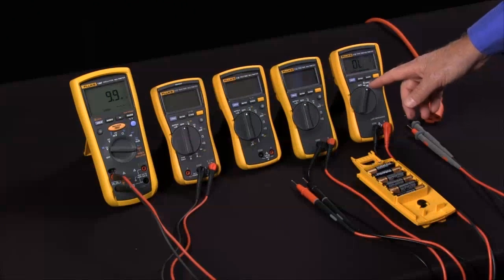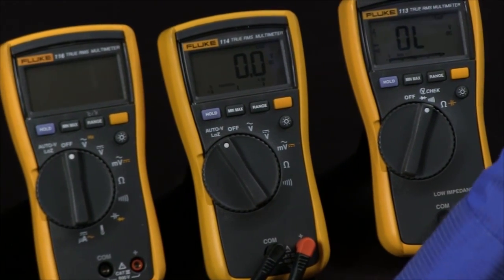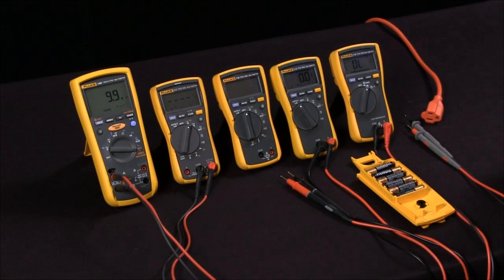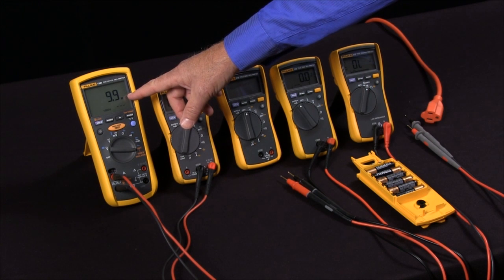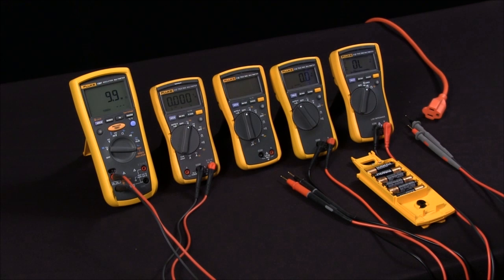In addition, this adds a feature that includes our Low Z. When I put the multimeter in Low Z mode, I have a very low input impedance of about 3000 ohms. Typically when working with a multimeter in any of the normal functions, we have a 9.9 or 10 megaohm input resistance. This is a very low load, so it's meant not to overload any circuits, but if we have an open electrical cable, there could be an induced voltage of 30 or 40 volts — too light a load to get rid of that ghost voltage.